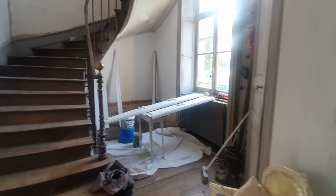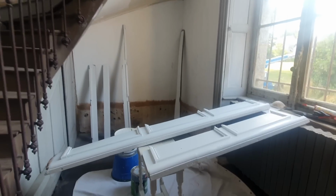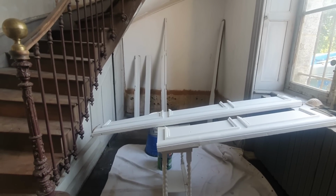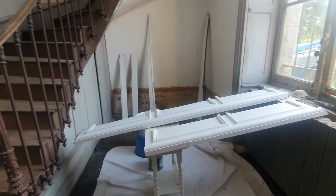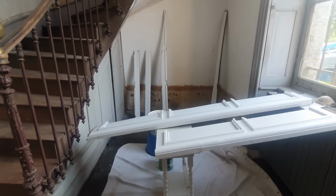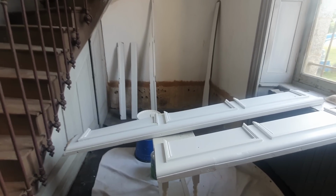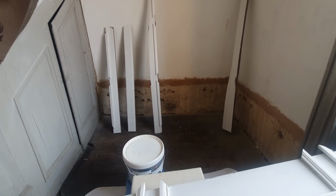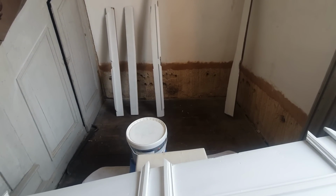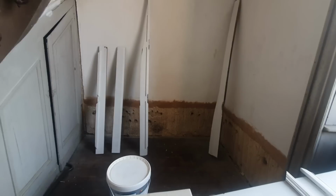So that's the end of another very long, tiring day. After these panels had had their nails covered with the stain block, I then gave them a water-based primer, let that dry, and then an oil-based undercoat, ready for the colour. But I'm not sure if they're going to go back together or not. We will see in time, but they can't be done until Adrian's done this floor. I've levelled up the bonding plaster so that can dry overnight, and we'll put a top coat on that tomorrow.